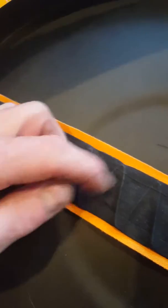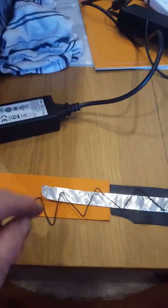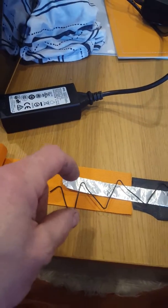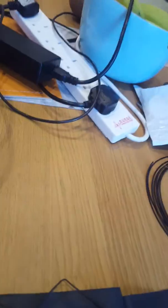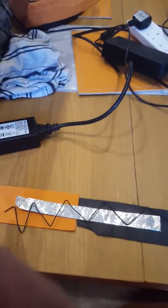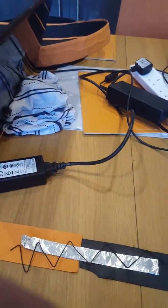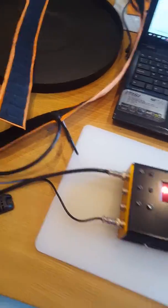You can see the wire inside the strap. What I did was I just got two nails 40 millimeters apart and then just wrapped the wire along to get that zigzag shape. If you need a meter of wire for your heater, you divide 1000 millimeters by 40 millimeters and that'll tell you how many zigzags will be in your meter length. Then if your entire strap needs to be say 500 millimeters long to wrap around your scope, you set out the concertinaed wire to 500mm long and just stick it straight onto your backing. That's it — new strap made, apart from wiring it up.